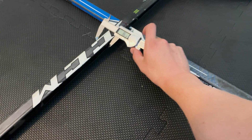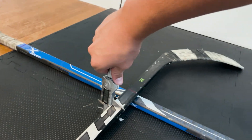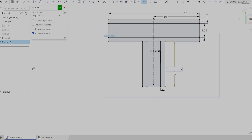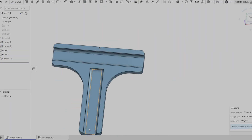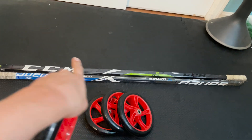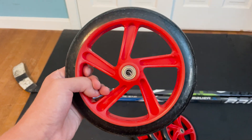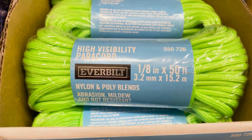For a lightweight and strong frame, I decided to go with some old broken hockey sticks, which are made of carbon fiber. Another big plus being that they're free. For efficiency, we need to use minimal electronics and use mechanical advantage within those systems. First thing I did was get some measurements of the hockey stick before jumping into CAD. I just got the brace for the cross piece, CAD'd it up, and while that prototype is getting printed out, I'm going to run to Home Depot and get some axles for these wheels — probably just some bolts, nuts, and washers.